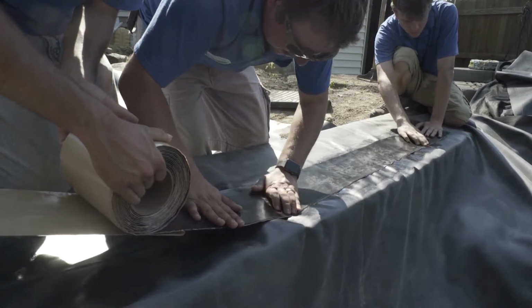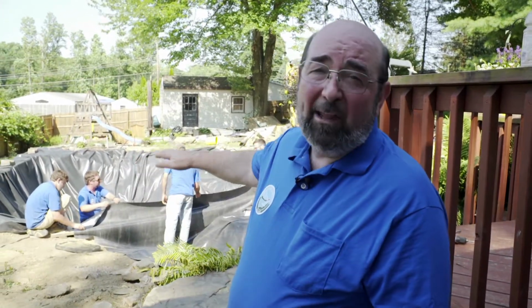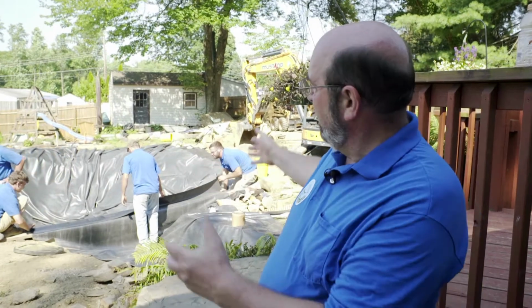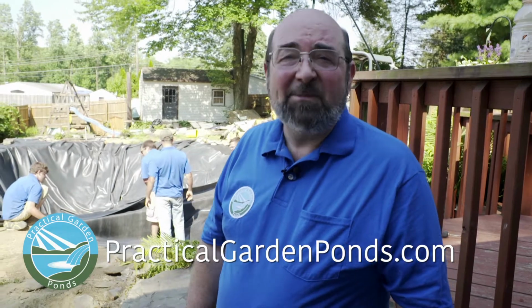So to recap, first we prepared the hole. We pulled out every sharp object and tried to make everything smooth and concave. Then we laid underlay all over the entire pond, at least one layer. Then we centered the pond liner in the pond so that it'll reach equally up all sides. Now we're seaming the riverbed liner to the pond liner so that there won't be any chance of leak between the two liners. On our next video, we're going to talk about four-fold filtration.